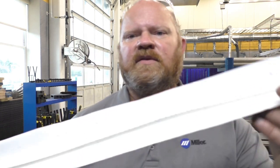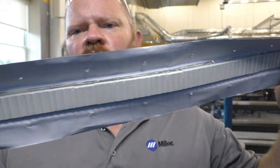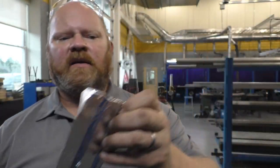There are two basic types. This ceramic right here has ridges on it — it's got little ribs. And the back side, of course, is an aluminum tape. The tape itself just has a covering on it you can peel off to go ahead and stick it up. You've got to remember the tape is aluminum, so it'll actually cut you if you're not careful — it's like a hellacious paper cut. Essentially what we're going to do is place the ceramic on the back side of the joint just like a backing bar, but afterwards it just falls right off. You take a chip and hammer and the ceramic falls off, the tape peels off, and you have a weld done all from one side.